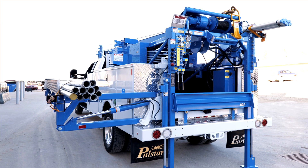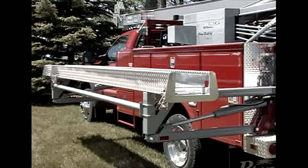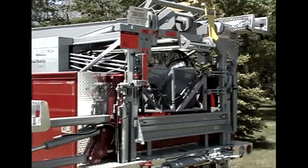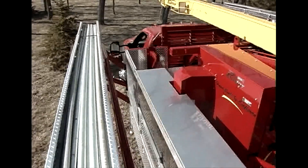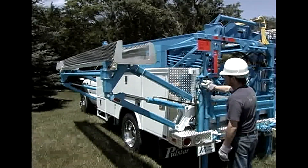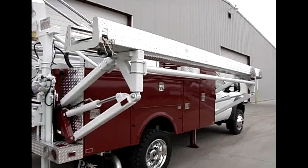Polestar has also designed it in such a way that the hydraulic pipe racks and mounting assemblies have been mounted to the service body, not the pump hoist frame. This makes for a working assembly that can be incorporated in many other marketplace functions. For example, various sizes and models of pump hoist can be mounted and utilized using this principle.